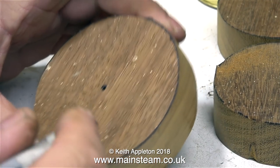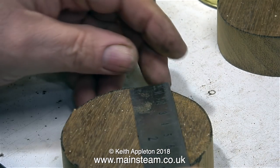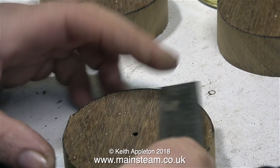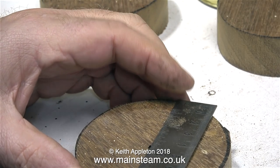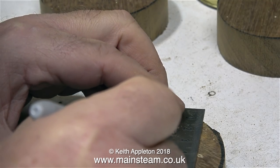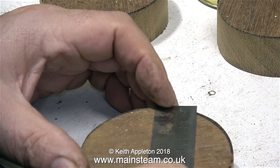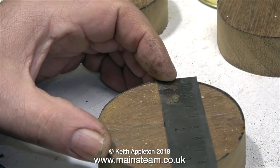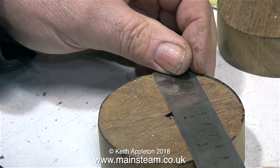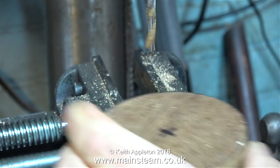The problem is, of course, that these pieces of mahogany do not fit in the recess at the bottom of the lampshade, because the line was drawn around the outside of the lampshade. I could have used a pair of calipers, measured the inside, transferred this to a compass, and then marked out a very accurate line, but I prefer this method. All I'm doing here is finding the centre of these pieces of mahogany by using a ruler — just by taking several measurements across the piece of wood, I can mark the centre. The next thing is to drill a quarter of an inch diameter hole on the centre marks of each piece of wood.